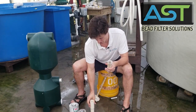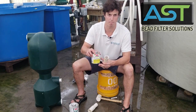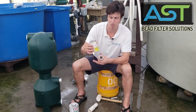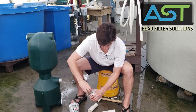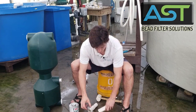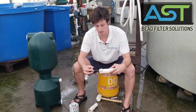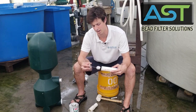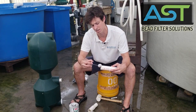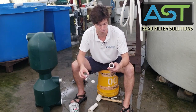Anytime you put two pieces of pipe together, it's very important that you prep first with clear cleaner. This is readily available at any hardware store. I'm going to prep the male end and use this liberally — the first inch to inch and a half of the pipe. I even want to get these edges, especially if this pipe is going to be under any amount of pressure.